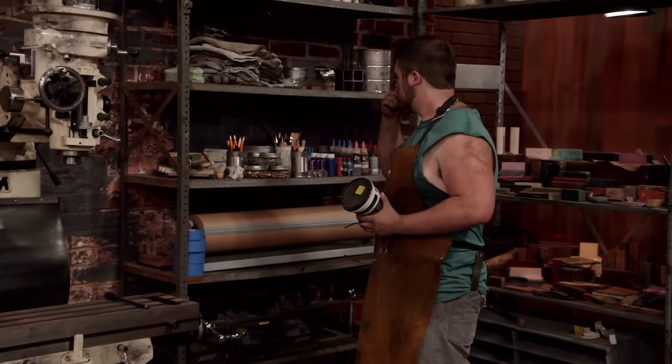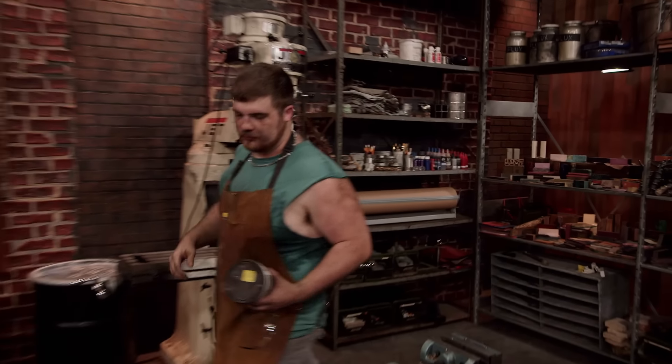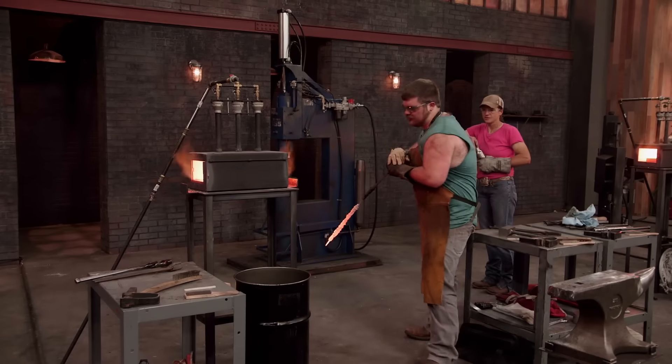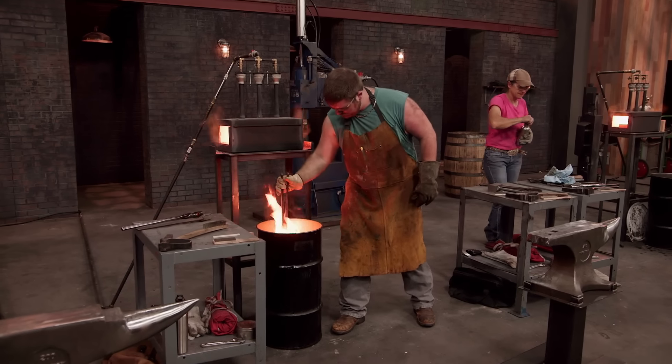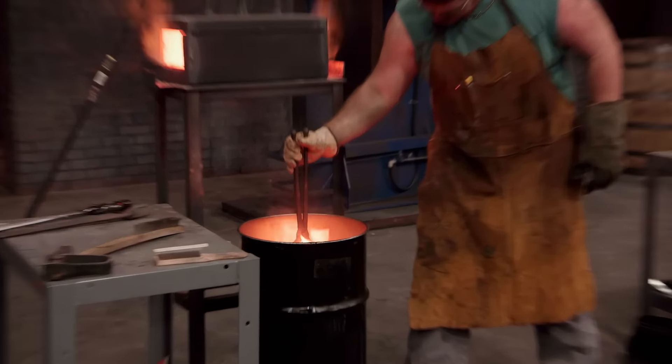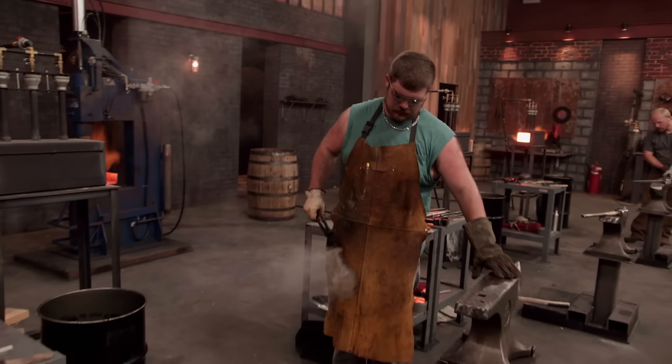Will just grabbed clay off of the shelf in the pantry. He grabbed the clay to try to increase the strength of the spine while retaining the hardness of the edge, so it would make an excellent chopping tool. He's in the quench. One of the problems he's going to have is a lot of fire, because that clay is absorbing the oil and it's not going to go out unless he scrapes it off.